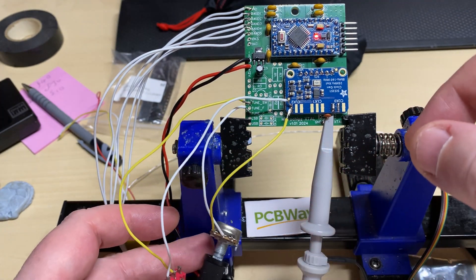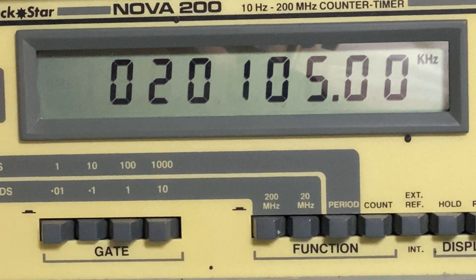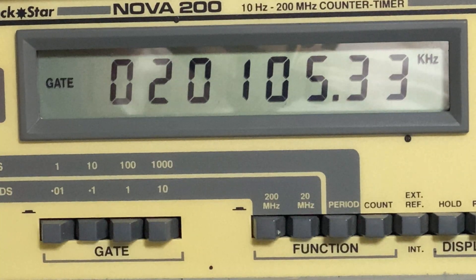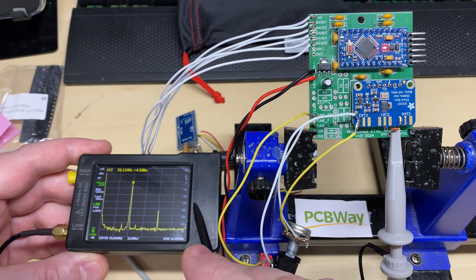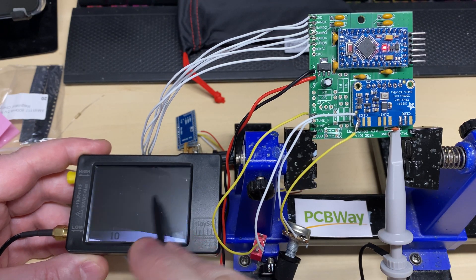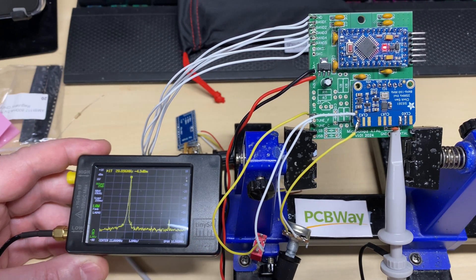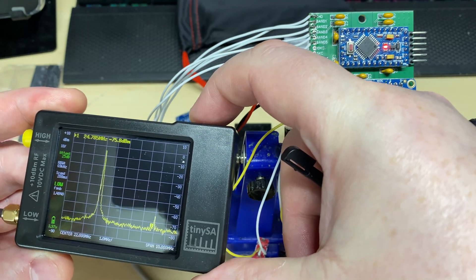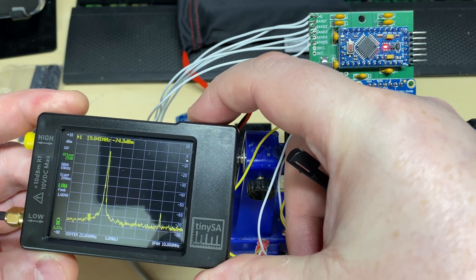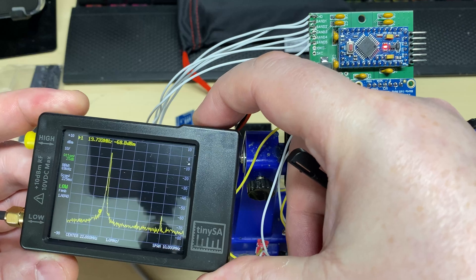Now we've got our tune — we switch the tune on and we can adjust the output frequency. That's going to be our shift, going plus and minus 5kc, but it is programmable — you can set it to whatever you want. The wider it is, the less precise it is. Let's have a look at the output to see how noisy it is. We've got our primary spike there, and a little bit of a spike on the first harmonic, but it looks clean enough.